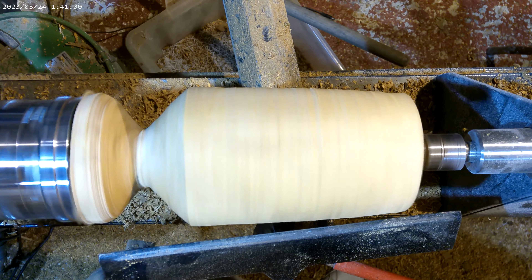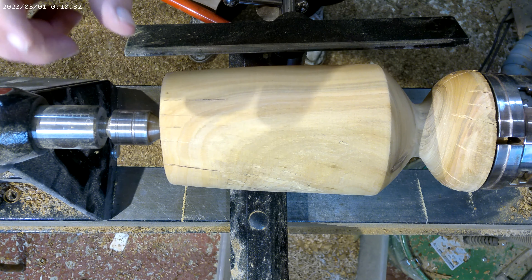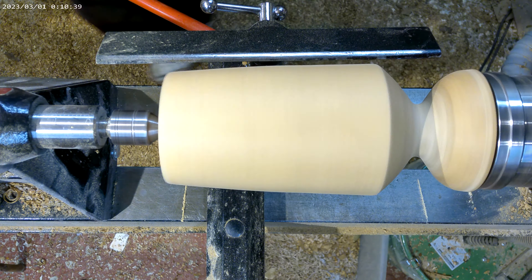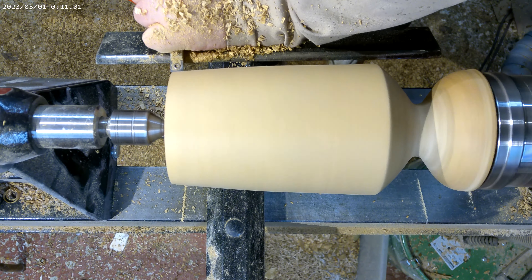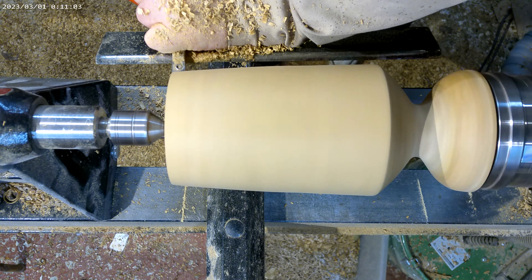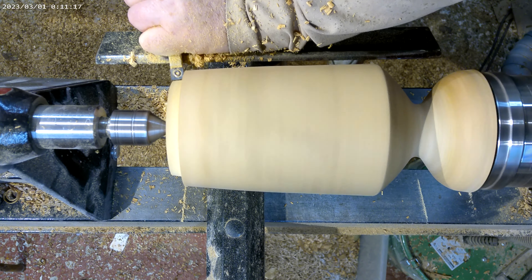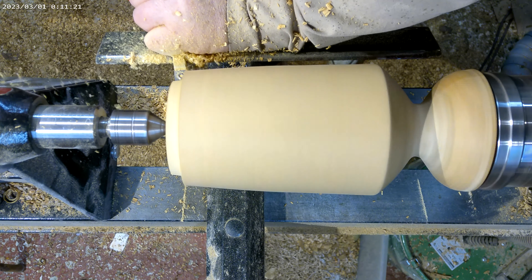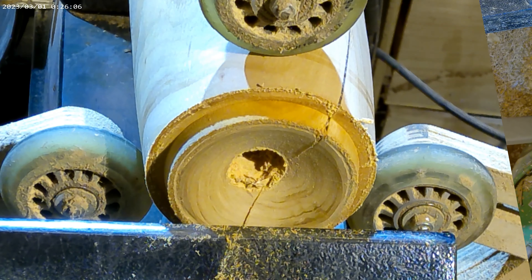Let's quickly sand that down and get back to you. What I'm going to do now is turn on here and leave a small upstand for the lid to sit over the top. Just straighten that up first and then go for the small upstand. I'm just going to put a small taper on there — when I make the lid sit on there it'll just fit down nice and tight. Then what I'm going to do is go to hollowing.